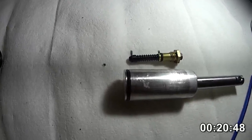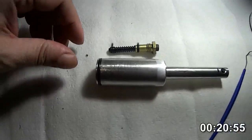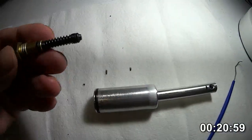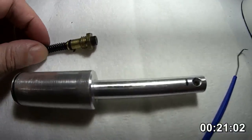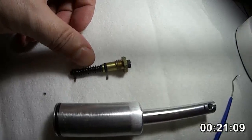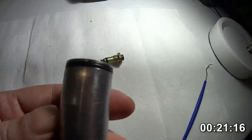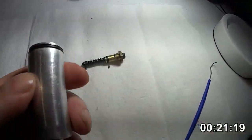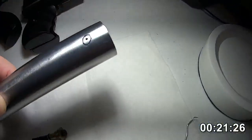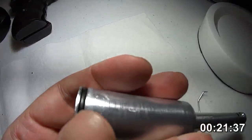If you're even a millimeter, even a half a millimeter off, the O-ring will not do its work as far as holding air. Now, this is going to outlive the gun much longer. These two O-rings right here on the valve assembly are probably going to be lasting for a really long time, whereas this one is probably going to be occasionally replaced, because this is the one that really gets the wear and tear. And even if you have a hole that has been machined properly, where it does have a proper chamfer and it has been deburred and polished behind that hole, even if you do and you're using your lithium grease, you're still going to have rub where that hole is.